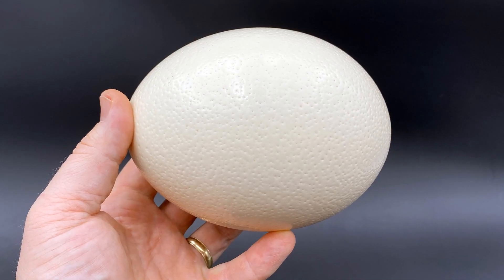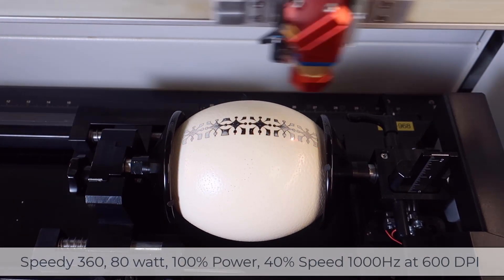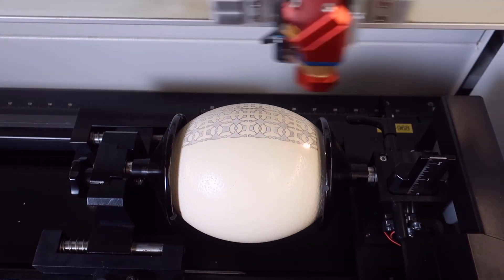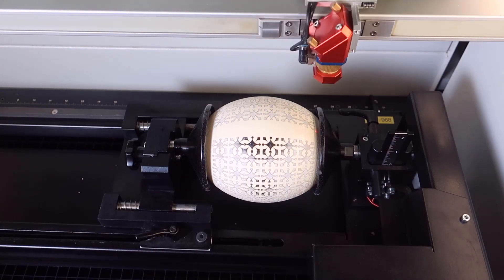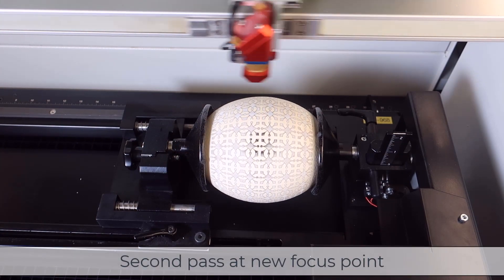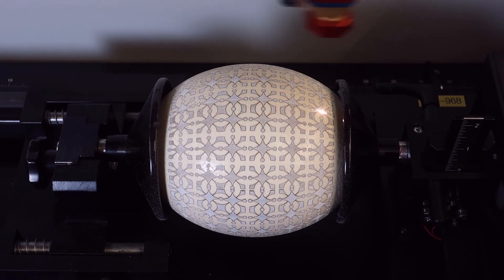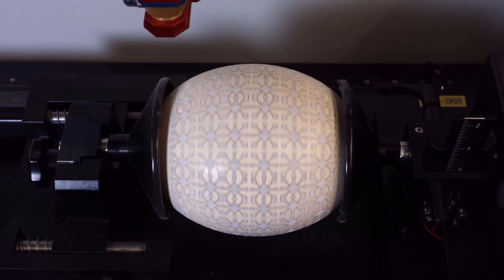Now let's scale things up with an ostrich egg. We're going to engrave it at 100% power, 40 speed, 1000 hertz, 600 DPI, using the rotary with the 4 inch lens. I'm getting some black spotting on the surface of the egg, caused by my focus being incorrect. So while it's engraving, I'm adjusting the Z height on the fly, moving Z up and down until I found the sweet spot. I now have a black spot to take care of, so I'm going to change the focus and run a second pass with my new Z height — it's really difficult to find the correct focus with this much curvature, which is also why I used a 4 inch lens, as it has a much greater tolerance. The second pass is also brightening it up, turning much brighter white and producing a stunning finished result.